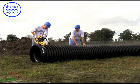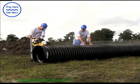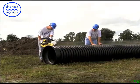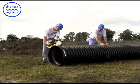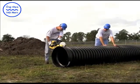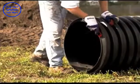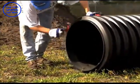Sometimes a pipe must be shortened on the job site. Fabricating pipe in the field is a quick and simple procedure. Begin by cutting the pipe to the desired length. Be aware that 12-inch and larger diameter pipe has a reduced diameter bell and spigot end — one or both of these ends may need to be removed to ensure proper joining of the pipe to a replacement coupler or fitting. Always cut the pipe in the center of the valley between corrugations.